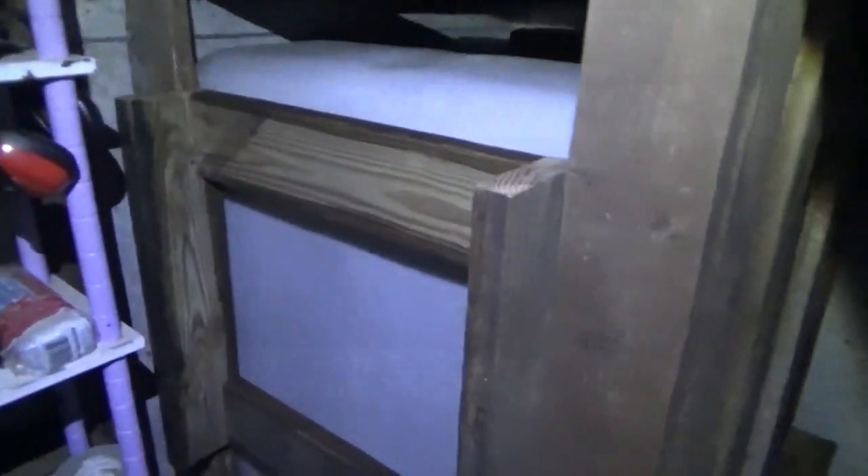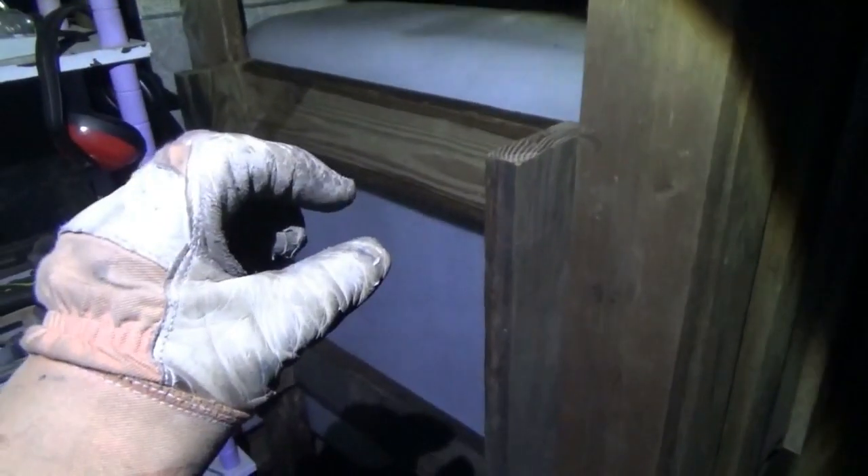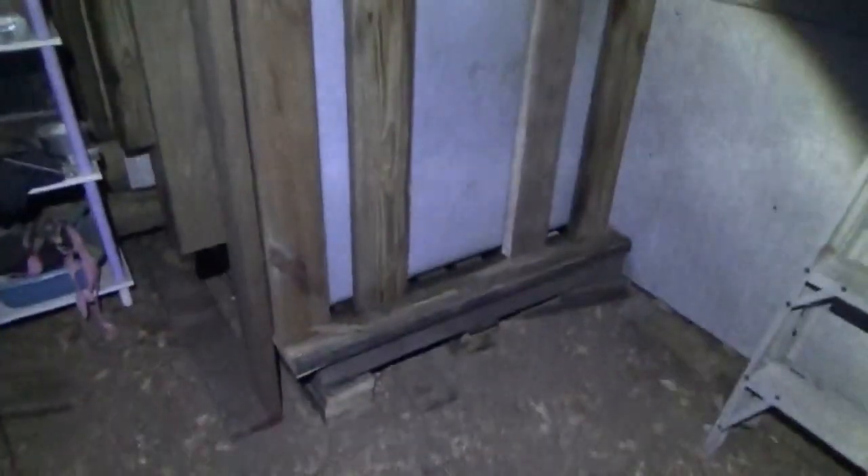I'm out here with a headlamp now. I've got the framing done. I'm not exactly sure I like this over here, but I wanted it to be very, very strong and to resist outward pressure from the water tank — because up here I had only the thickness of the 2x4 or 2x6 to hold that from squishing outward, and I wanted to be able to nail in securely. So what I did is I built a square frame and then I put a frame in the frame. I can still access the valve down there. Now I'm going to tie these two corners in together, and then I'll tie in the pallets — top and bottom — to everything.